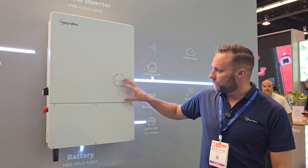It's got several different modes. You can do an economical mode, time-of-use mode, and a self-consumption mode as well. Self-consumption mode basically means you can say, I want my loads to get most of what's coming out of the PV.